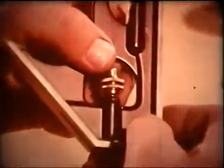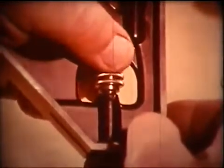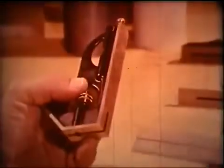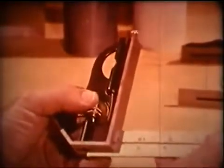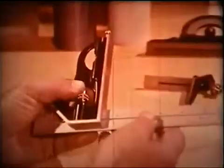To fit the head attachment and blade together, simply loosen the locking nut and slide the head onto the blade. The tongue on the locking bolt fits into the slot on the blade. If the head doesn't slide on the blade easily, don't try to force it. Check the alignment of the tongue on the slot. When the parts are properly lined up, they fit together easily.